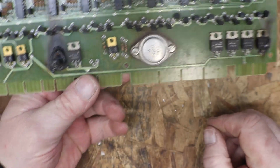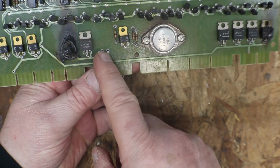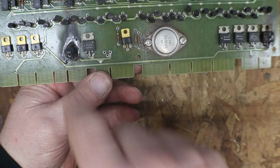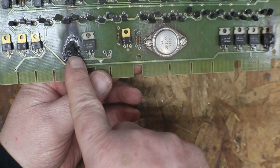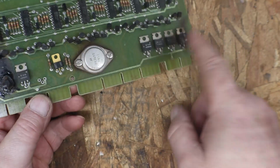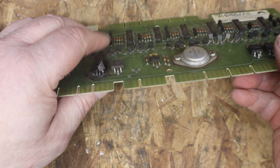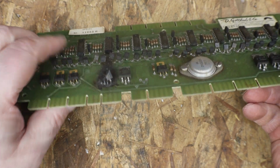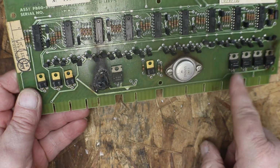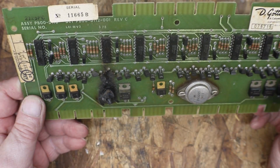Now, if I'm not mistaken, I think it might be these three is the upgrade on this, to put a diode on this outside leg. And that keeps it from getting a feedback and going up into your MPU. So we know we're going to need some transistors on this one too, so we'll get some stuff going. I'll check these, I'll see what those are, and get some of those coming too. Those should all be our lamps, or part of our solenoid, or lamps up top, whatever. But we'll get that stuff coming too.